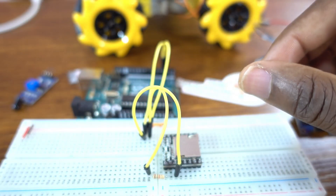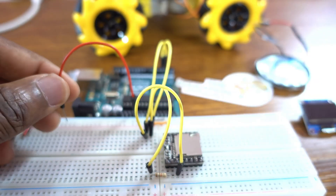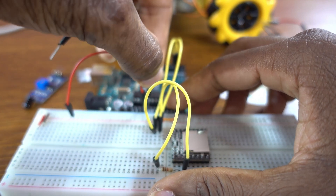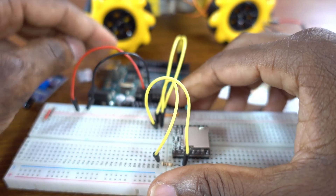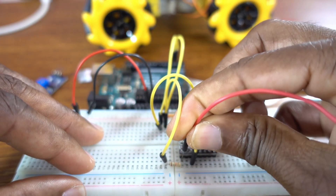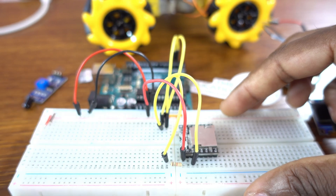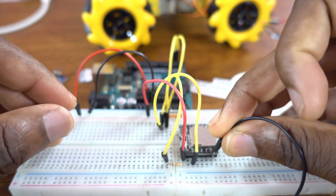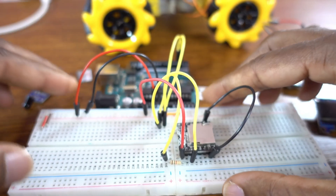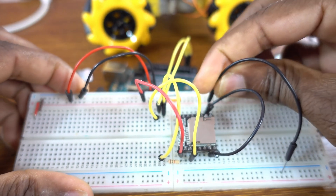In the code, the VCC goes to 5 volts and this is ground. We attach the VCC to the Arduino 5 volt pin. The DF Player Mini has two ground pins — both need to be connected to ground.